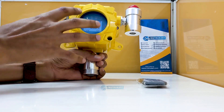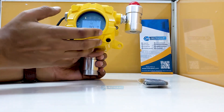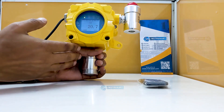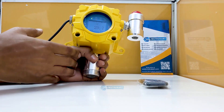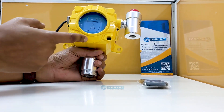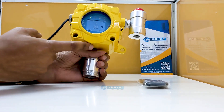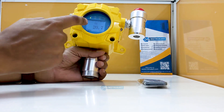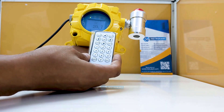It's a totally flameproof body along with the hooter — not many brands will offer you that along with the hooter, which is its unique selling point. This is a fully explosion-proof body, and it comes with an oxygen sensor with a range of 0 to 30 percent volume and an accuracy of plus or minus 2 percent at full scale. As you can see, this is an LCD screen and it comes with an IR remote for operation.